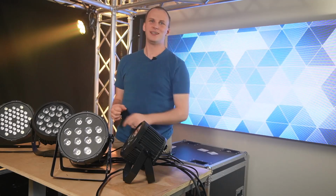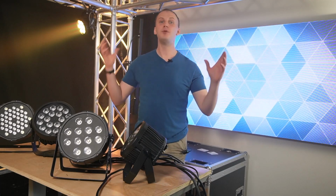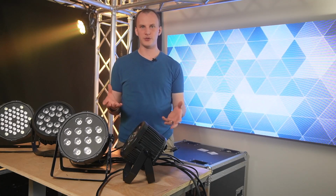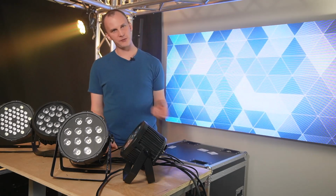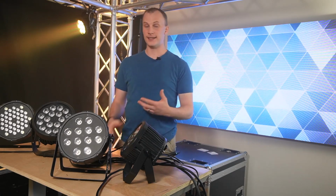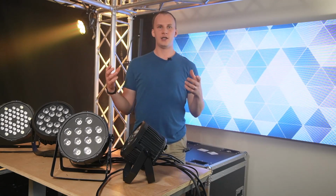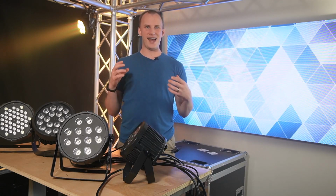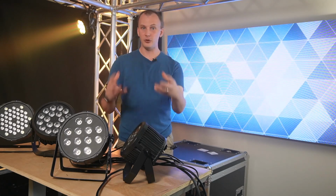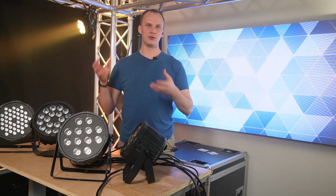All right, so now that you've waded through that intro, let's break the ice. A PAR, or PAR can, actually stands for something. It's an acronym that stands for Parabolic Aluminized Reflector. And what that meant basically is in the old school PAR cans, what I started out with when I was working with lighting, you had a sealed lamp that had a reflector behind the filament of the bulb. It was actually part of the bulb. And that's what defined what a PAR was.